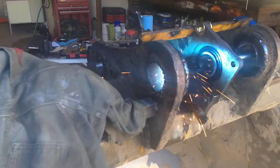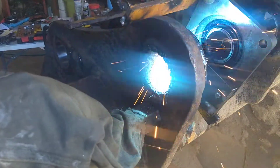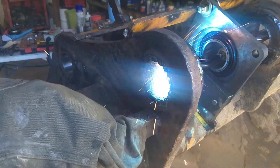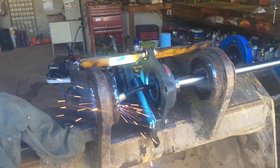As you can see, it definitely does hard work. This whole one actually put some straight-up layers in when I had a couple of big splatters to pick up with what I had going on. So I went ahead and recut it flat before I laid in the third pass.